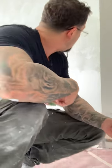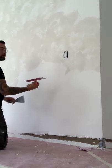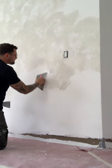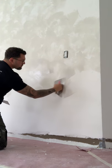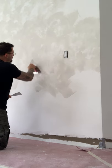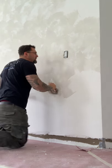We're doing the second coat of the All World Venetian Plaster. It already has the base coat and I'm doing the second coat application. All World basically uses the skip trowel technique — put it on, clean up the trowel, come back and do some swirls. I like to do it a little bit smoother, so I'll come back and flatten it out a little bit.